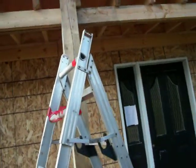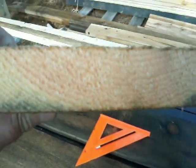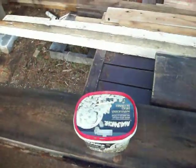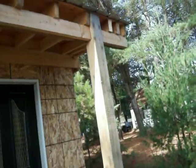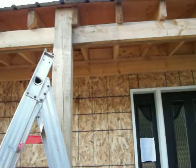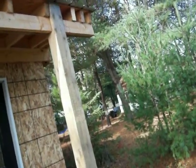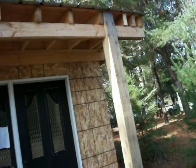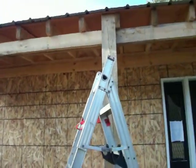So today's job, I'm going to try and close this in with some fascia board. I've got an 8-inch wide fascia board here. Because I'm using rough cut lumber and not pressure treated, I'm using inch-and-a-quarter board, which is really heavy to maneuver when you're up in the air by yourself. I had some specialty cut 2x2s cut so I can fill in underneath the rafters, between the posts, and after the post and up to the rafter. That way when I put the fascia on, the fascia sits nice and flat, and there's no gap underneath for critters to get up underneath.